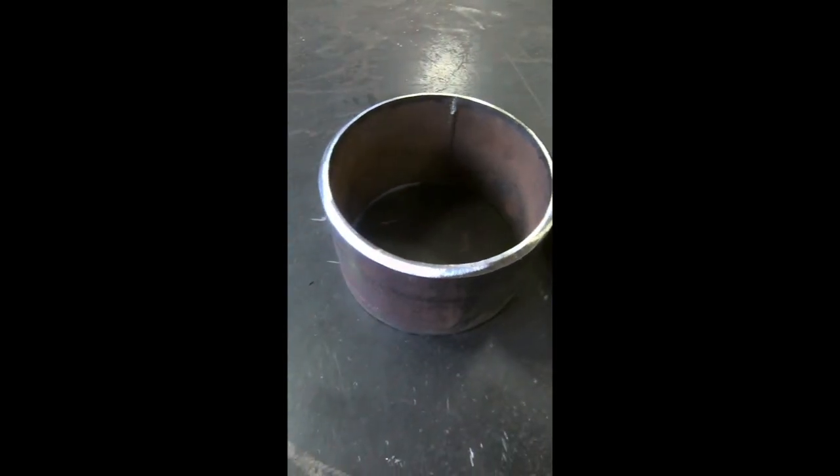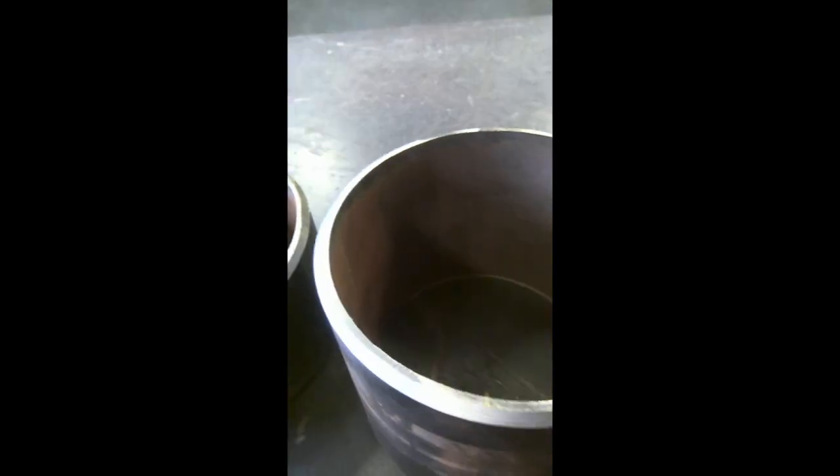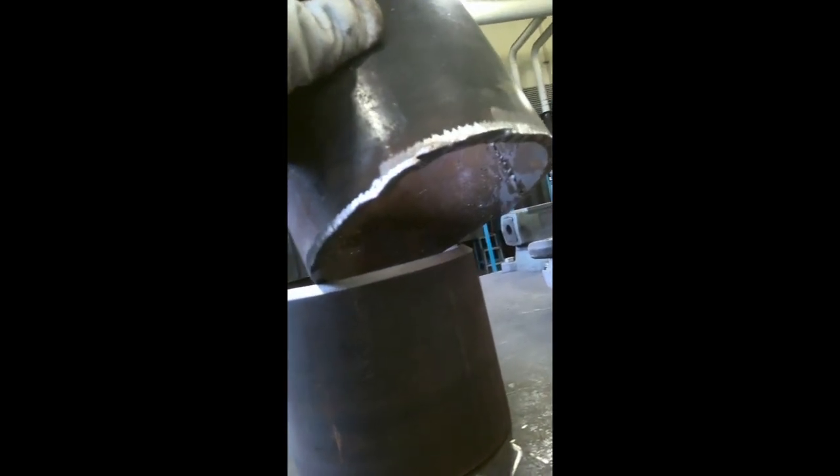So we got our coupons grinded down. Notice in here we have taken the lip away — it's nice and smooth. Got me a welding rod here to check my land size. Eighth of an inch, that's what I want. Got a nice smooth edge on it. I like to set it down and look through there — make sure you don't have any light showing. If you got any light showing through there, if it's kicked up, that means it's not going to sit flush. Notice this one over here — obviously a little jagged edge cut. That's why I tell y'all, try to make the best cuts you can, because you're going to have to grind it down flat to put another bevel on it.